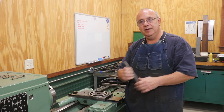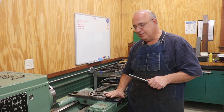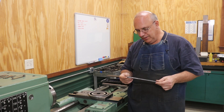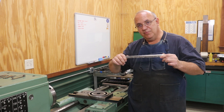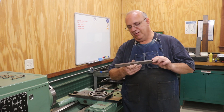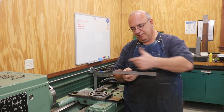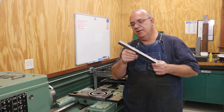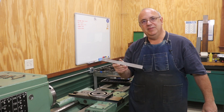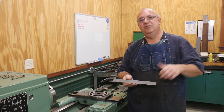The gib is made out of cast iron. On these mating surfaces that are rubbing against each other, you want cast iron on cast iron — you don't want steel on one of them. I had a question recently come up asking about what material to make a gib from, and the answer is you make a gib from cast iron; that's just the right material to use. Fortunately I've got a piece of Durabar here. This is an extruded cast iron, and I basically cut out a little piece on the bandsaw. So I've got a chunk of cast iron that we can make a new gib from. We've got a lot of material here and a lot of material removal to do, but I think that's going to be the content of this video — making a new gib to fit on the lathe. So let's start designing a new gib.